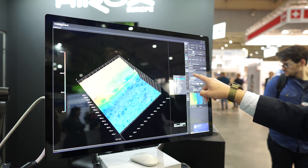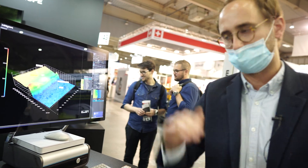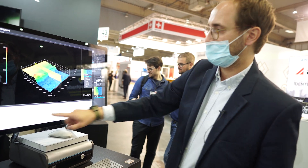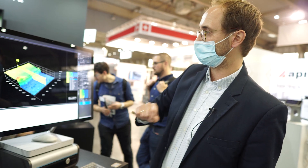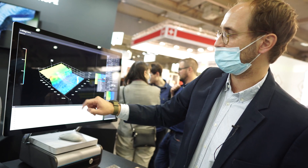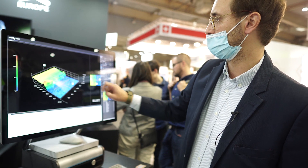Using a point measurement system, I set a reference point and ask the system to tell me the height of two points. I can see the tape is around 100 microns high. For even more precision, I can quickly make a profile and see geometrical forms — angles, radii, etc. — for measurement. I can also click on roughness: here the floor roughness is about 0.1 microns and the tape roughness is quite the same in this case.